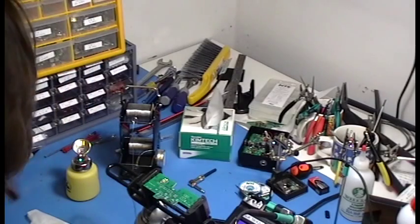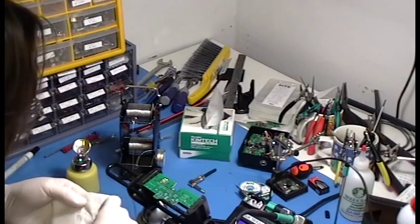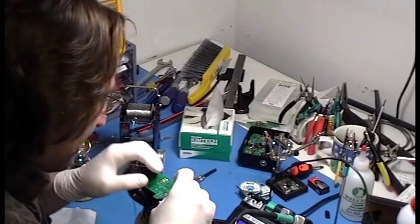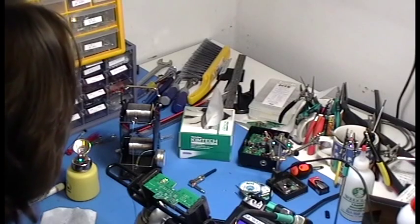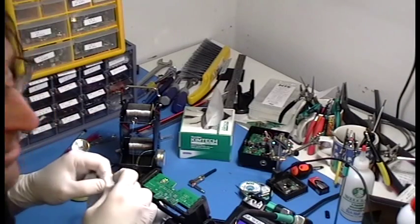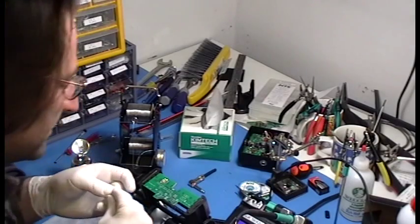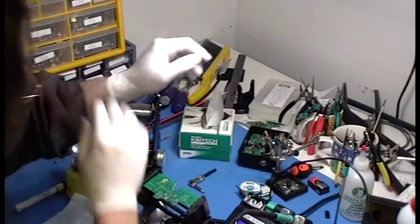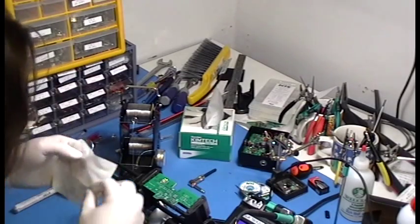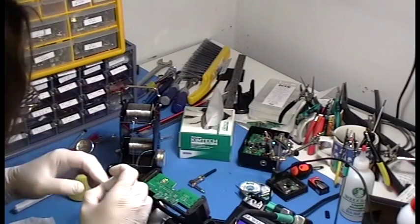There we go. Okay, it's just going to take a minute. You can hear that we're actually getting them squeaky clean. That's what you want. These particular resistors are actually pretty clean. The caps I have are really dirty. They're filthy. And you'll see that when we actually get to them. You're going to be surprised at how much stuff actually comes off those caps. But now you can see why I'm really wearing gloves. If I didn't wear gloves, I'd have this. I mean, other than the cleanliness of the board, if I didn't wear gloves, I would have all this IPA on my hands. And anybody who's worked with a lot of alcohol will tell you that will dry. It's nasty. It will dry out your hands like you wouldn't believe. So it's mostly to protect me.